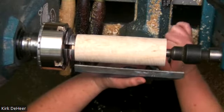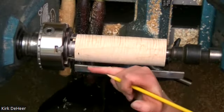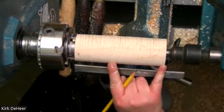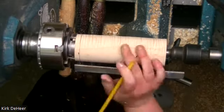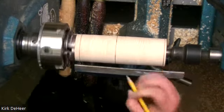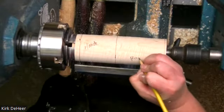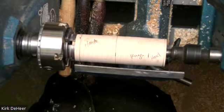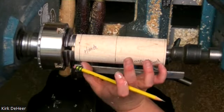The way that we lay rattles out: give yourself some room away from the chuck. You want about a third of your rattle to be the handle and two-thirds to be the captive rings and the head of the rattle. So here away from the chuck — that gives us enough room. I very rarely lay this out; this is all for your benefit because I'm lazy. This will be the handle, this will be the rings, and this right here will be the head. This will be about five and three-quarters inches when we're done.